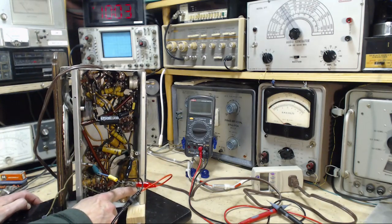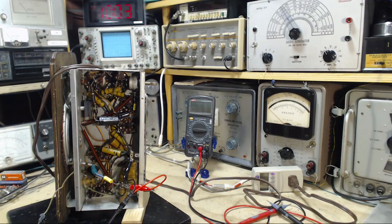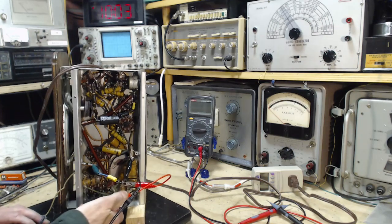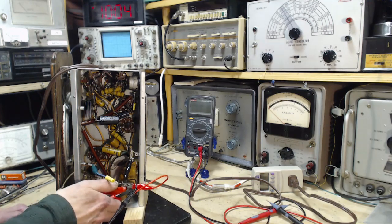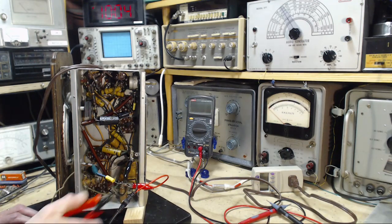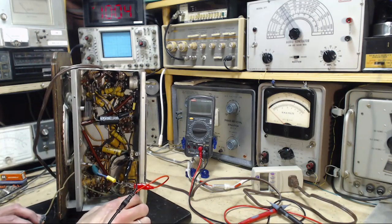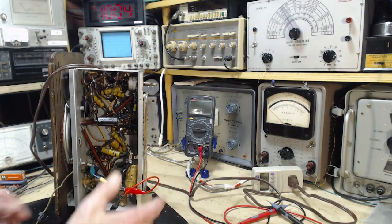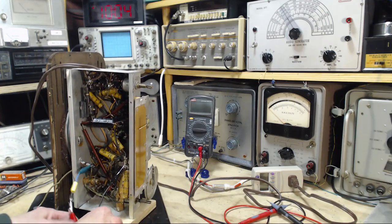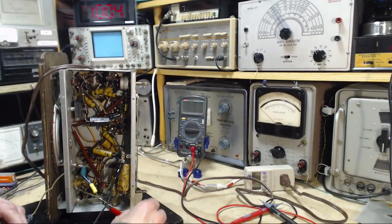So I'm just going to nip it off here. We'll leave it in the radio for now. Maybe I'll test it right away. I'll have to nip off the resistor too. Because it's a great big capacitor, I'll leave a little wire there. Okay, if that's off, I'm going to nip open the resistor. Pull this guy out a bit. There he is. Oh, I said I was going to operate the radio before I did that.